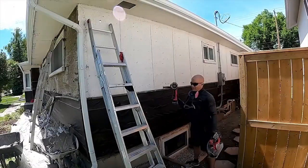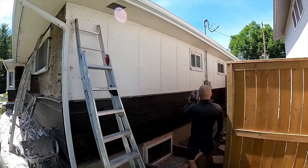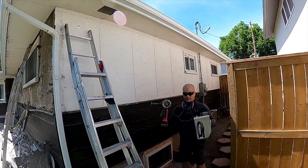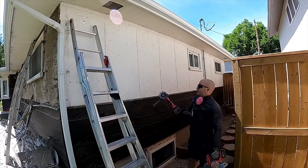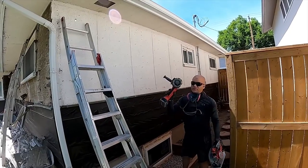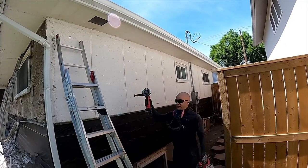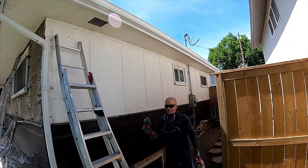I have finished getting all my big cuts in with the seven-inch saw. Make sure you get concrete blades for whatever tool you're using because regular blades are no good. In an effort to make things go faster, I do all my cuts with one tool first, then go along all the cuts with the smaller tool at the top and bottom, then along with the hammer and the trimmers to get all the last little bits at the top.